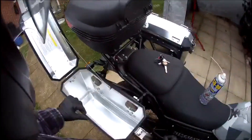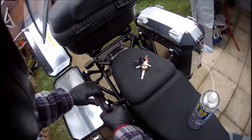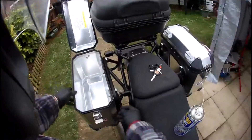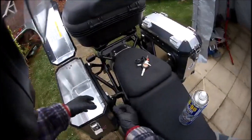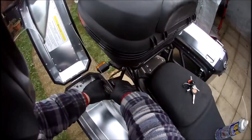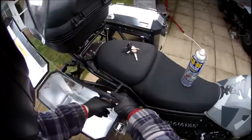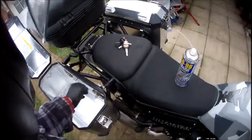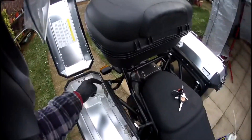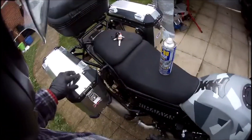The thing is on there and it's sturdy. But watch this - if you look, it's a straight line there. If you do it up too tight, you're going to pull this line out of true, and then when the lid goes to seal it may be allowing in water. Just literally nip it up so it's in the keyway - you don't need full force, this will split. Then pop your locking nut on just to stop any movement of the wheel, so the keyway doesn't fall down and the thing drop off.